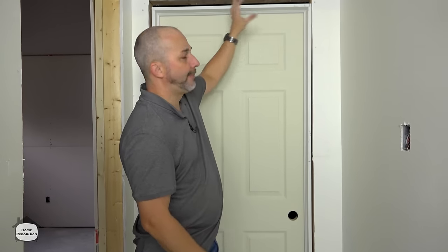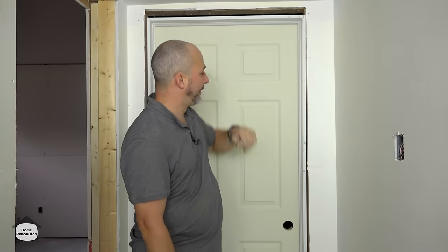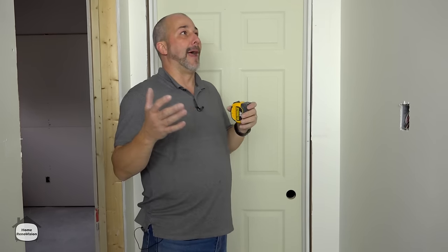First, make sure that you have enough room for full pieces of trim all the way around your door. This technique only works if you have enough height to put on your casing before the ceiling, and room on each side for the casing as well, because you can't custom scribe your casing and then install your door. That's just ridiculous, it's totally backwards.